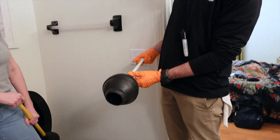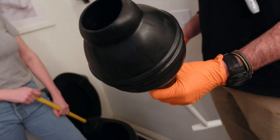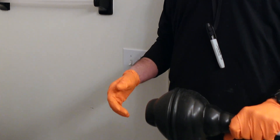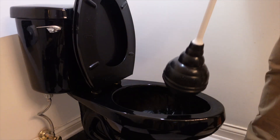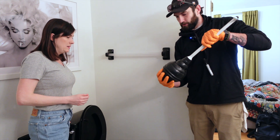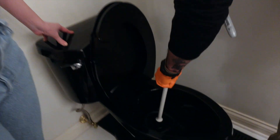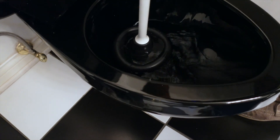The wave of the future are these nice beehive plungers. You can pick one up for under 20 bucks — it's totally worth it. One of the cool things about this one is that you can fold it in so now it's essentially a sink plunger as well. The idea is that you're wanting to push as much air and water down through the toilet to jar things loose as you can. The beehive has a rounded bottom that fits down inside the toilet, so you're going to have a lot less splashing. That air and water is being forced down into the toilet instead of out the sides.